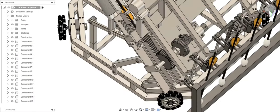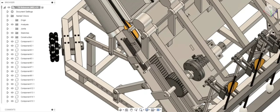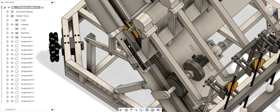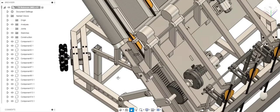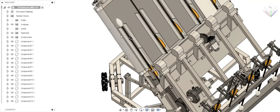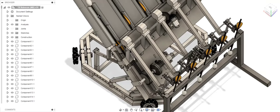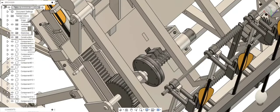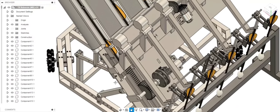In doing so, we extend this spring — one is here and the other is here. By extending the spring we basically store elastic potential energy in it. Once the required extension is provided so that the arrow can be shot to the required target at the required velocity, the clutch can be disengaged and all the energy in the spring is released at once.